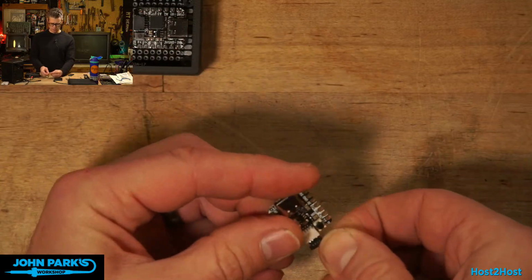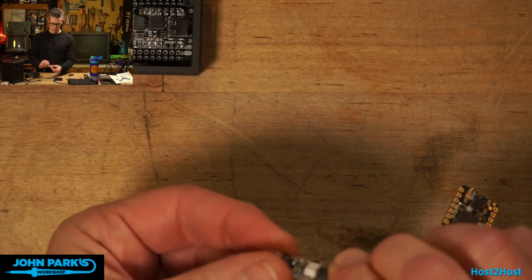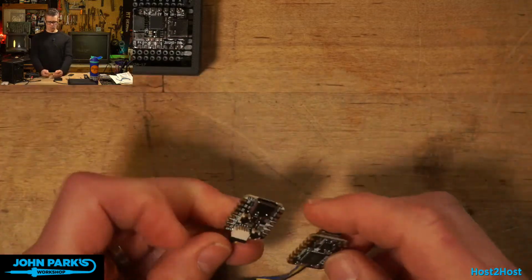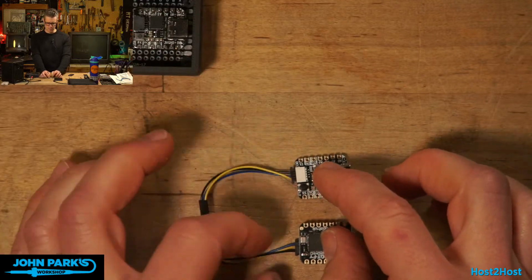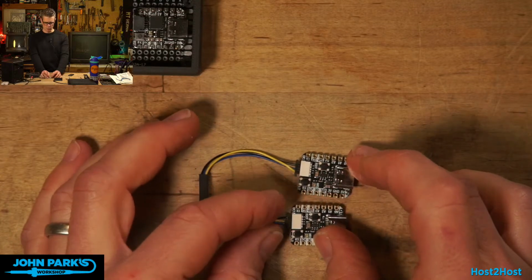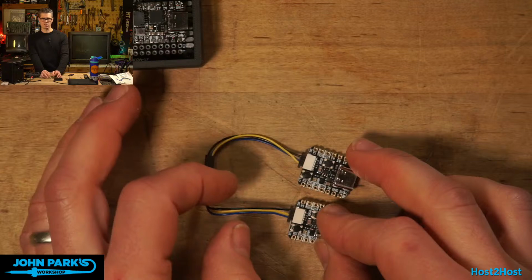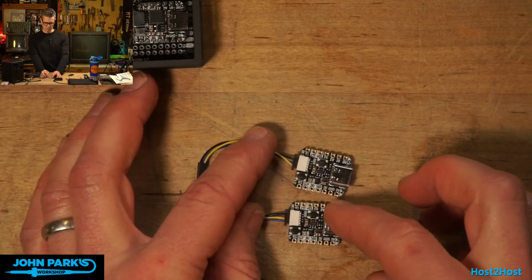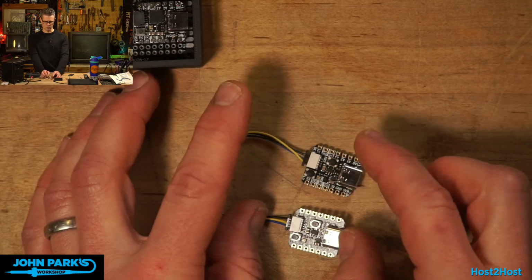and run the pins 22 and 23 to 23 and 22. Those are the names of those two pins in Arduino. And I've set them up as PIO software serial, so you can use a PIO to do software serial over those pins. Normally you can only do TX on one of those pins, you can't do RX, but software serial made that possible.